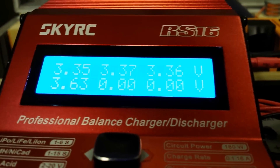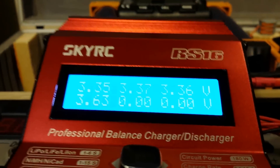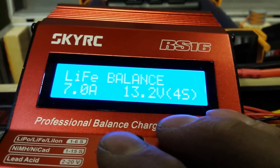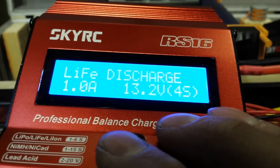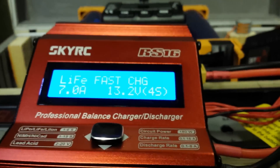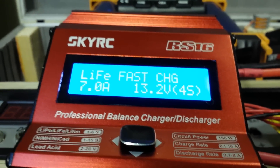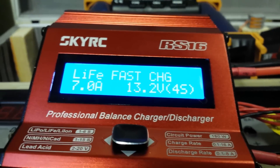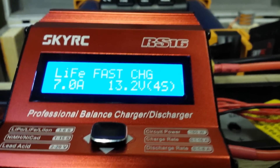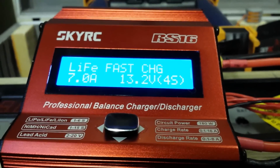I can't get this camera to focus properly so I'll have to use my proper camera next time. I'm going to finish this charge now. If I did the balance charge, that would bring them all together. If I did the fast charge, it would negate some of that very low charge towards the end — it would probably just do the bulk and not do any of the constant voltage near the end with the low current. I might try that, but first I think I'm going to balance these next time I charge them. I'm happy with that little test — surprised about the amount that went into the batteries, because there's still plenty of capacity left.